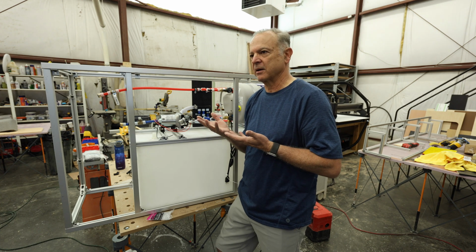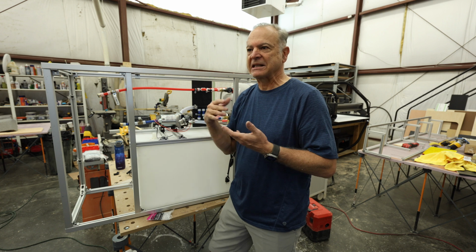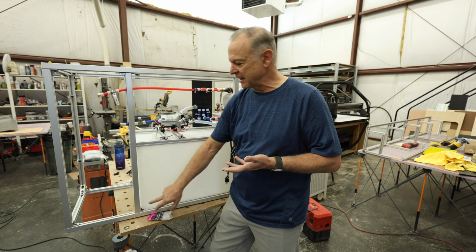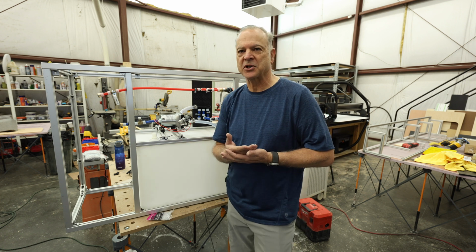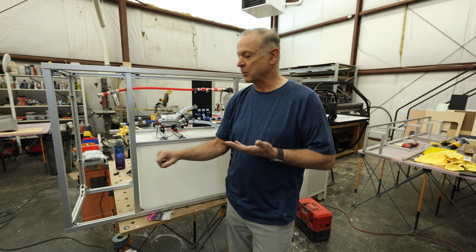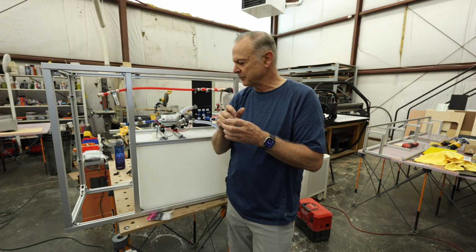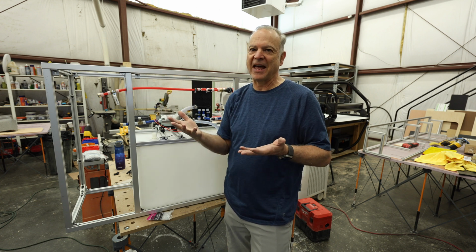In fact, our second or third van, we used to put the fittings in the bottom and the tank was sitting up above. On the day of delivery, we had tested everything, but we filled it with water the night before and let it sit overnight. The next morning we came in and there was just a little teeny leak in one of the fittings down on the bottom of the tank. The customers were showing up in an hour, and we didn't have time to do anything. So when they got here, we had to tell them we were going to have to swap this thing out. We ended up having to pull the panels off, take the tank out, and redo the fitting because where it was threaded in was leaking, and then put it all back together. We had to send the customer away for about 4 hours and have them come back to pick their van up because we had this leak.